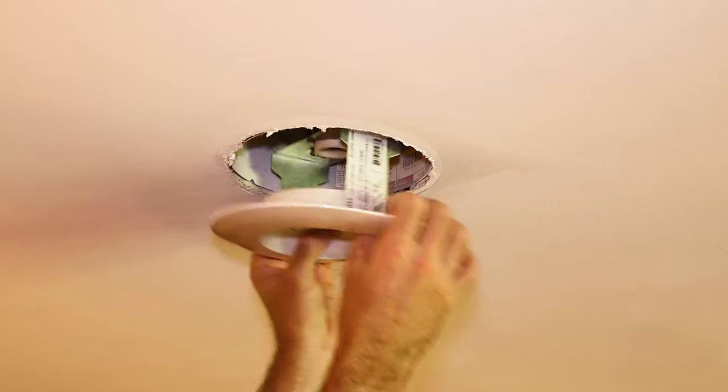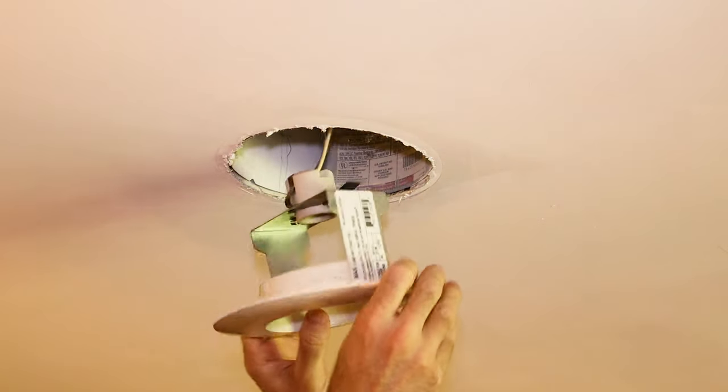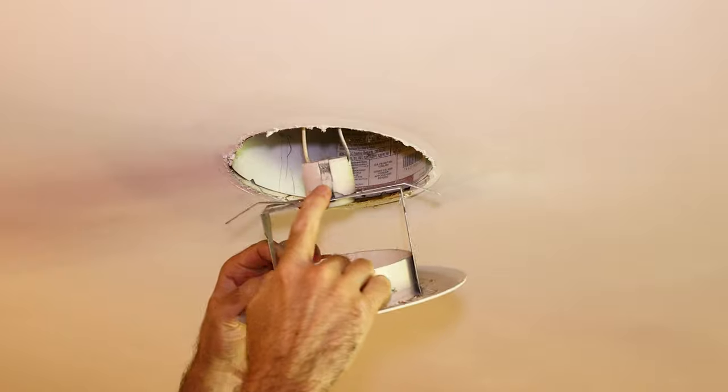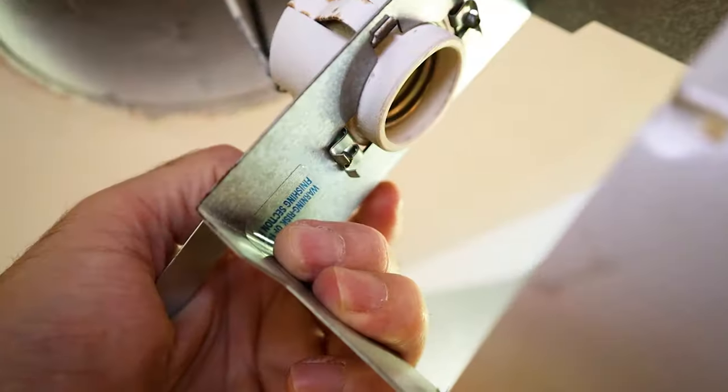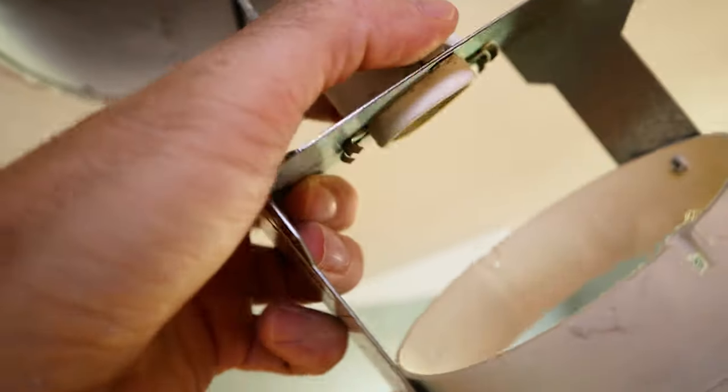Let's go back in time. The first step is to turn off the lights for a bit so the bulbs cool off, and then unscrew it. Pull down on the flange to remove, and then press on the tabs on the socket to completely take it apart. Okay, let's see that again, but closer up.